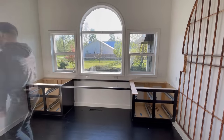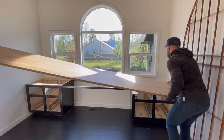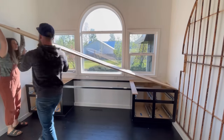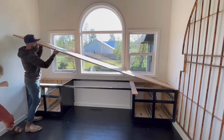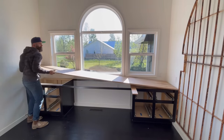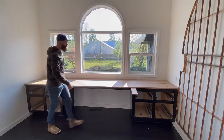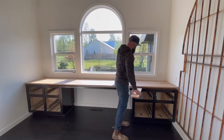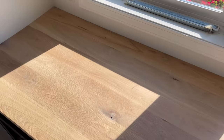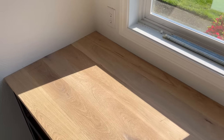Once my finish was dry I enlisted the help of my wife to carry the top and put it in place. I had a scrap piece of ply resting on top of my cabinet boxes — I do this when installing a piece between two walls. It helps if the piece can bend a little as you lower the far side down against the wall, allowing you to get into a tighter space. It fit in absolutely perfectly. Yes, it takes longer to make a template and cut it with a router, but you can't argue with success. This wall was far from square — had I just cut it, there would have been gaps in each corner and along the back. But as you can see, it's perfect.